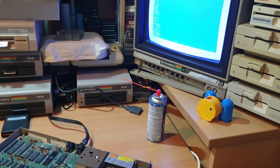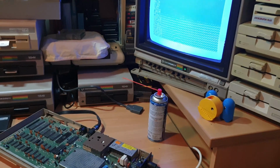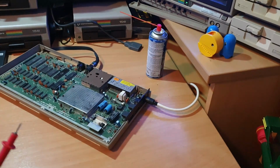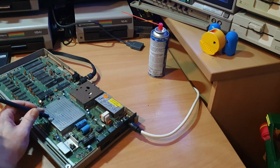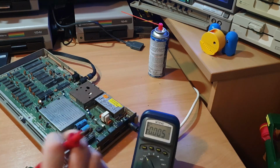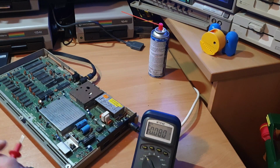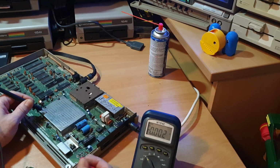So I've got that set there. Go to the voltage regulator, whether you can see on camera or not. Nope, getting you completely off the camera. I've gone down to the voltage regulator. All I'm doing is putting my earth on there. Bring that up so you can see a little bit. You get the earth off the tin shield. Earth's an earth. You can pick up earths anywhere you like.